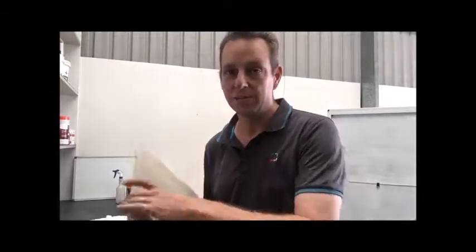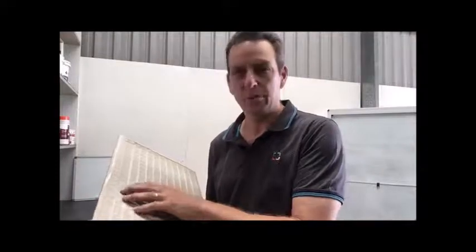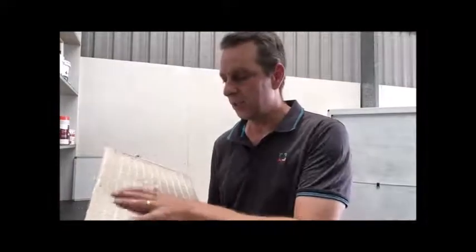I'm certainly cautious about saying you can stick to tiles, but in this case it's a non-slip tile. It doesn't appear porous, and when you look at the back of it you can see that it's monolithic - homogeneous throughout. So I'm doubtful it's going to have any porosity to it, but I'm wondering whether we can get some kind of mechanical bond to it.